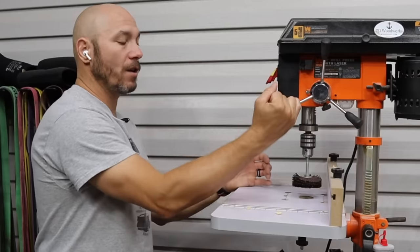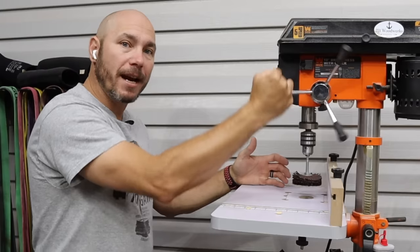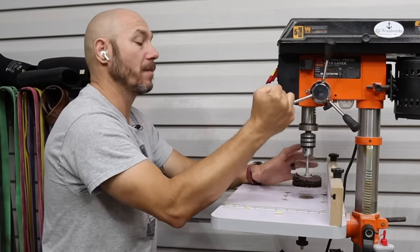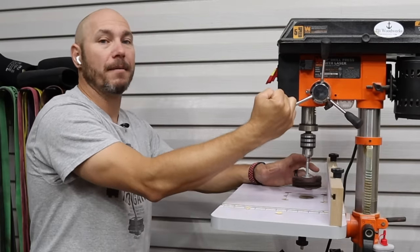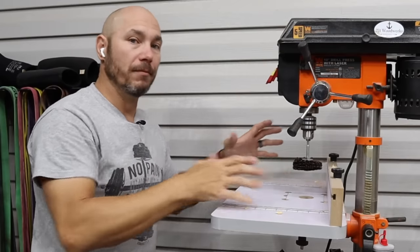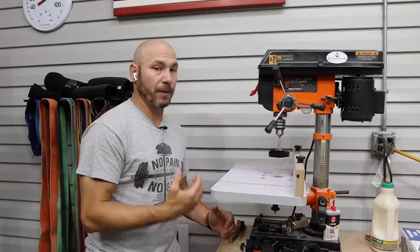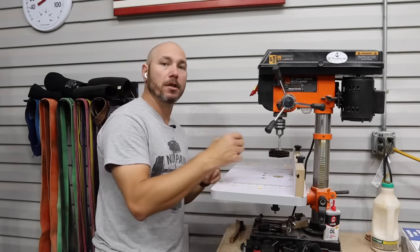Is it kind of a safety feature? It can be. So I've got this drill press — if I had a bit in there and I'm drilling something, I've got a hand on the crank and a hand on the work piece. If something goes wrong at any point — if something gets hung or whatever while I'm drilling — all I've got to do is just take my foot off the gas. The power stops and then I can deal with whatever issue I've got. A lot of people have scroll saws and this is great for that because you can do your work, take your foot off the power, reposition, do your work, things like that. At 20 bucks or less for this convenience, it's kind of a no brainer.